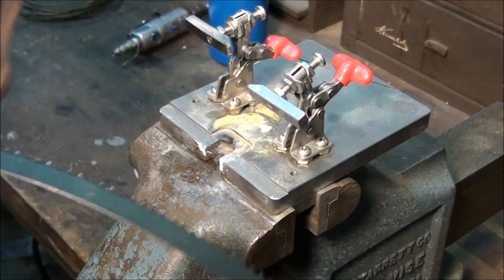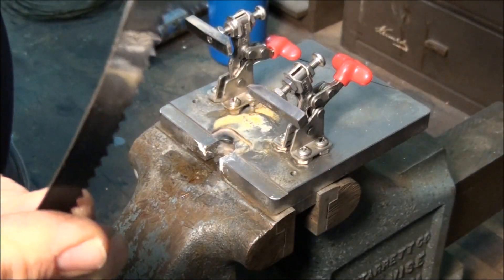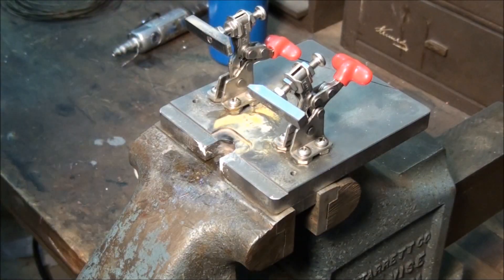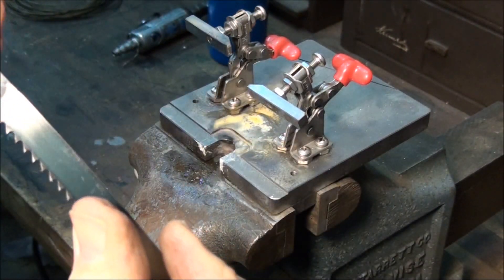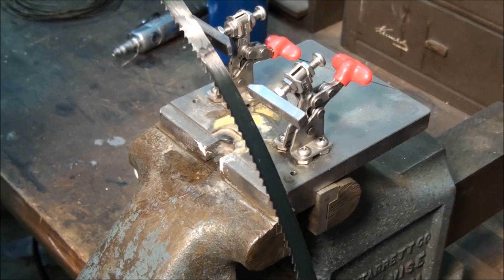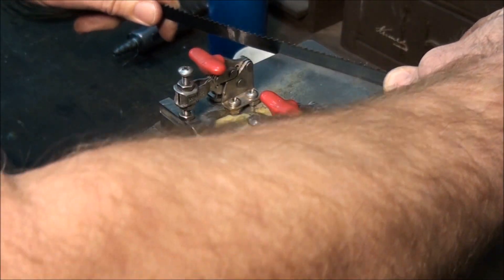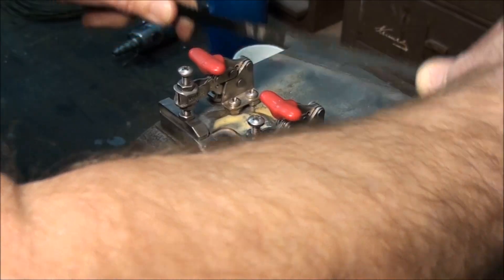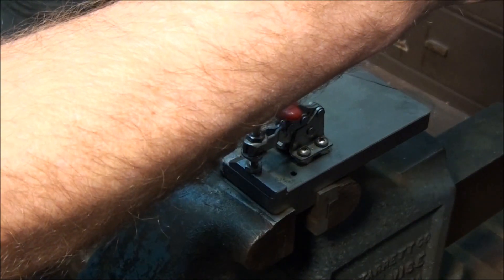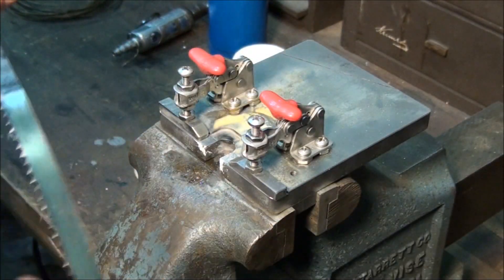I like to touch the back side of the blade a little bit to make sure there's nothing built up on the back. And that's all there is to it — that's all there is to silver soldering a bandsaw blade. It actually takes less time to do it this way than it does to weld it. You can also use the saw cut in the fixture to check and make sure the joint is dressed down enough — it won't go through if it's still too thick. I just use the saw cut as a gauge.